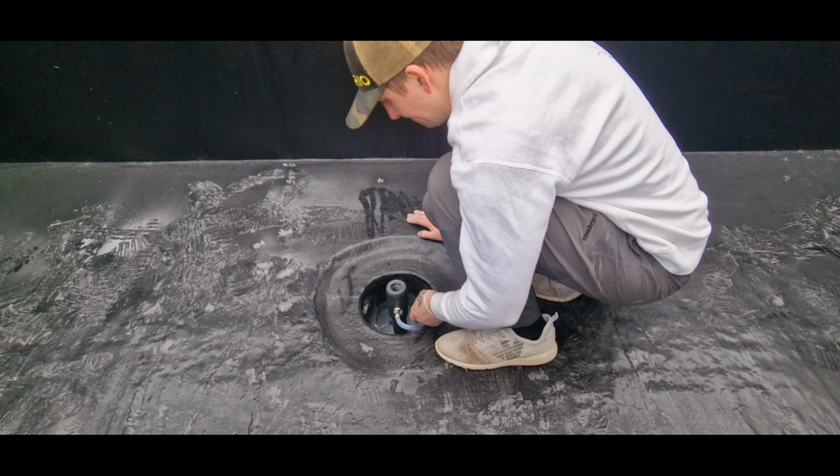It'll be the furthest away valve, but the nearest, the left-hand side return. And then this one will be for the heater through the right-hand side return. Just got to cut the bits of pipe, 35 centimetres, 27 and 22, and then hopefully everything should go well. I'll get back to you once I've cut the pipe.